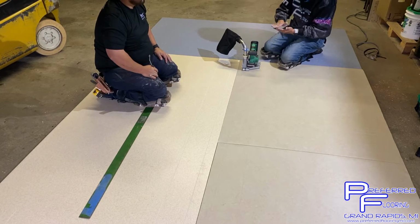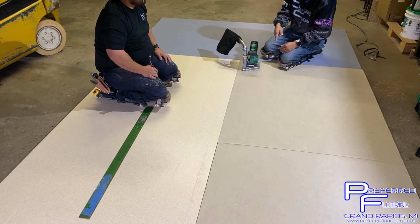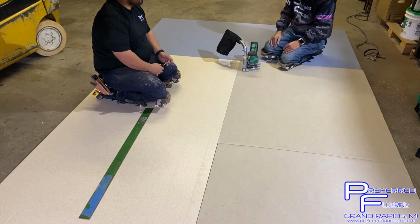And if you're going over something, when you have those little sharp bumps, sometimes you miss something on prep, the blade would essentially plow through and go too deep. Right. This is to prevent the blade from plowing through that high point and making a weak point in the weld. Okay.